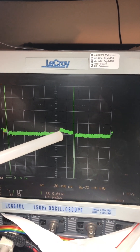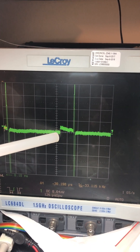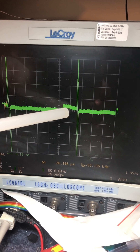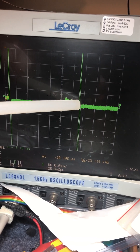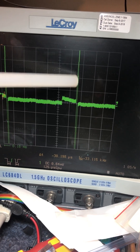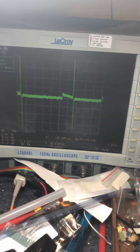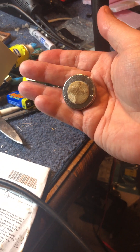This line here — that's the transmit pulse. It's actually meant to be down but I've got the probe the other way around, no big deal. Normally where you'd have a pulse with vertical lines, you only have one — that's the back EMF off the coil. This one has it going in both directions, which is rather unusual.